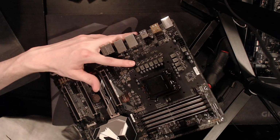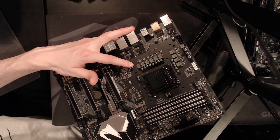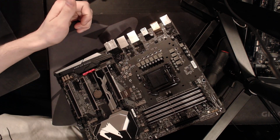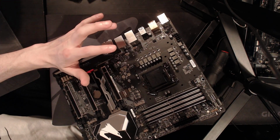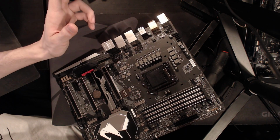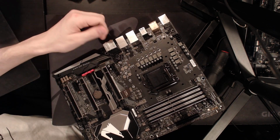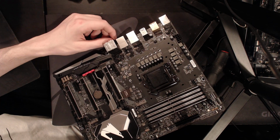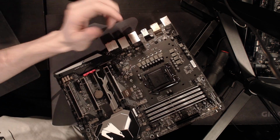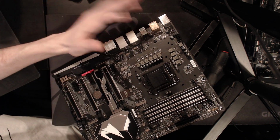And these are also really expensive power stages. Last time I was checking the prices for these, they were about $5 a piece. And that was if you were buying them in bulk orders of 3,000 units. So these aren't cheap, and they're generally only used on X299 boards, as far as I'm aware. Well, and some ITX motherboards, because if you're on an ITX motherboard, the VRM can't be physically big, so you need to do everything within your power to minimize the amount of heat output. And one of the ways to do that is to use really, really high-end power stages.